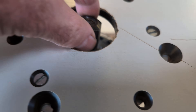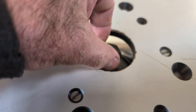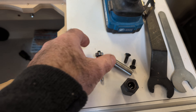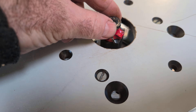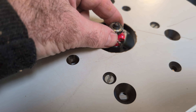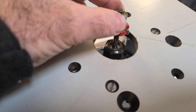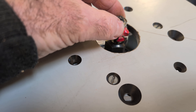So first we're going to use a quarter inch collet. Put the screws in here — it should never come off, just loosened up. Then that quarter inch shaft goes inside there. It doesn't drop and seat right down on top of the collet — it comes up a teeny bit. If it comes up a lot you're going to get deflection in that shaft, so you want it as deep as you can get it without touching the collet itself.